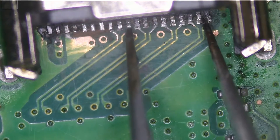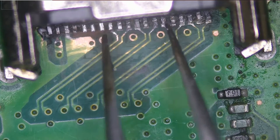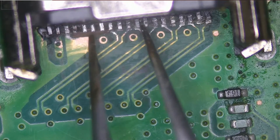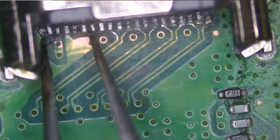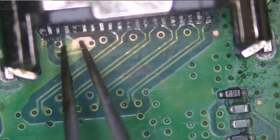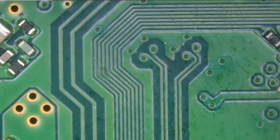Under the microscope: this pin is loose, this one is semi-connected, loose, loose. So almost all the pins are loose on this board — not a single one properly connected. And these are the missing pads here. It shouldn't be too difficult to take that port out because almost all the pins are not soldered.